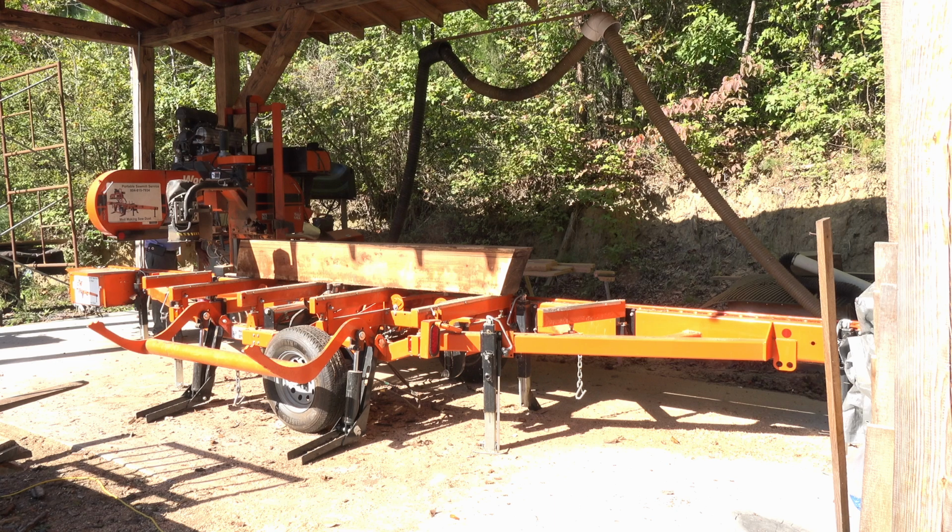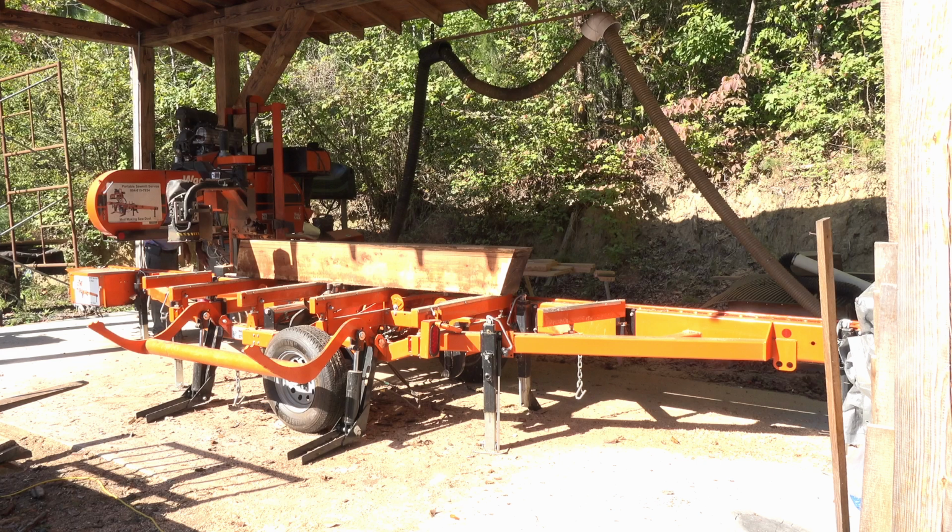You can't straighten a crooked sideways board, but you can lay a board down and get weight on it and lay it back. Or when you nail it down, whatever you do with it, you can always flatten it back down. But if it curves with you, that's a waste of board. That means you have to flip the log, flip the cant, and cut it back the way it ain't curving left to right.